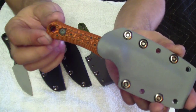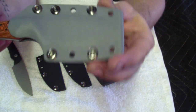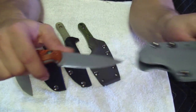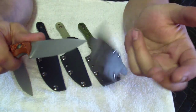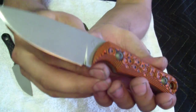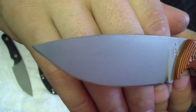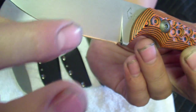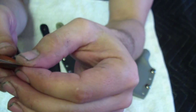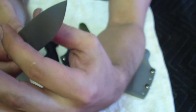So did the orange and black — I do like this a lot, you'll see. This one has a regular fold over take-down, grey kydex, nice retention. Stone wash, my traditional stone wash, full high convex, nice and acute bevel — it's under 15 degrees per side so it's gonna cut well. Nice and thin grind.